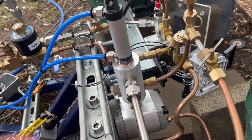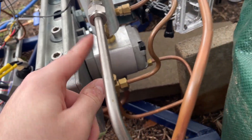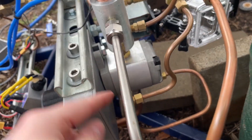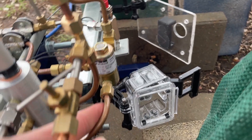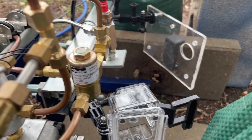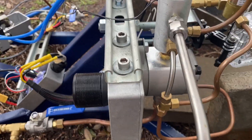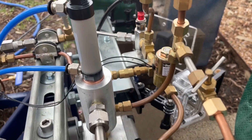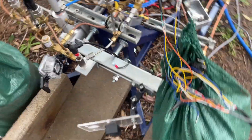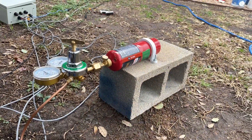The outlet goes directly into a custom poppet valve that I designed to act as the main fuel isolation valve — this will control flow to the thrust chamber. Tapping off upstream of that valve is a small solenoid that I found at industrial surplus, and that is controlling the flow rate of kerosene to the igniter. For these tests, the fuel pump is mostly just deadheaded and that little valve taps off for the igniter.